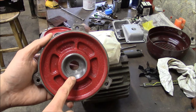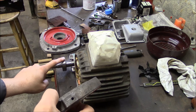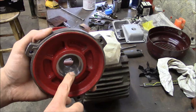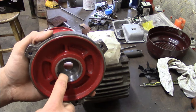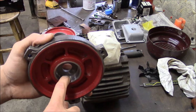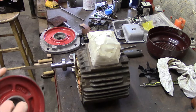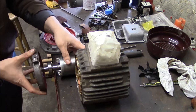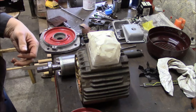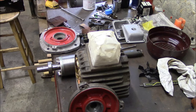That's a lot easier. So the bearing is 47 millimeters. That's 1.8504, I believe, inches. And all I did was bore this ring out to about 4/10, 5/10 undersize. And then I just used some real fine sandpaper to polish the bore to the exact size that I want. So it's basically now just a tenth or two above the diameter of the bearing. So it's a real nice sliding fit on there. And that's what we want. Yeah, 5/1000ths of slop in that journal, not gonna work.